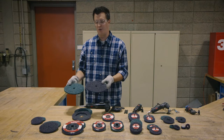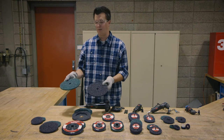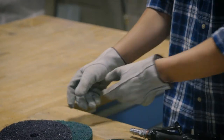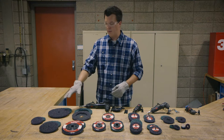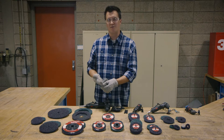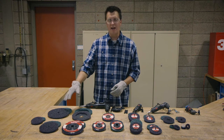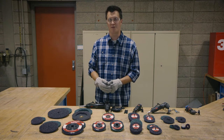The main difference between the two of them: the XT Pro has silicon carbide mineral, whereas the XT Pro ExtraCut has aluminum oxide mineral. The silicon carbide works really well for light rust, paint, light to medium mill scale, and applications where you don't want to scratch or damage any of the base metal.